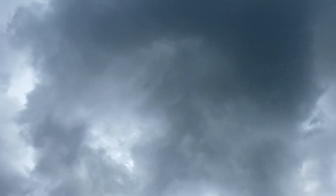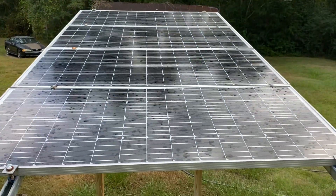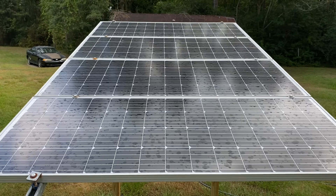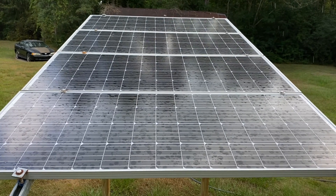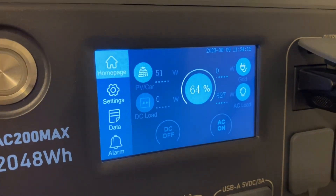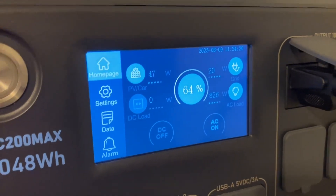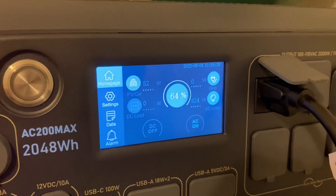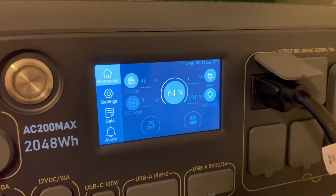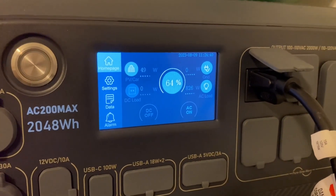We've got a little rain starting to come in - I'm not too upset about it. I'm going to let this keep running; I think this is just going to pass over. We're going to keep running that air conditioner and keep bringing in solar - we'll see what kind of watts we're pulling with this rain. It's raining pretty good out there right now. On the 800-watt array I'm getting about 45 watts, and on the 300-watt array there's 15 watts coming in. We'll check in about an hour - I think the shower will probably pass.